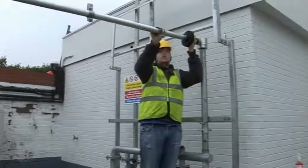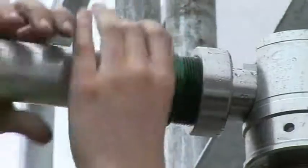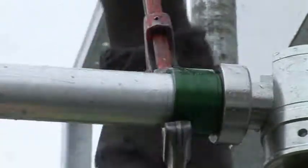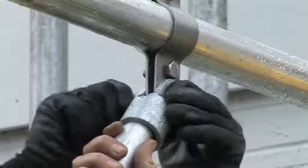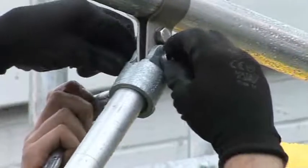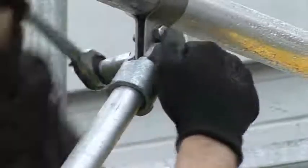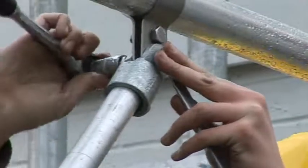Once the 2-inch aluminium riser is assembled, it can be secured to the knuckle joint. At this stage, the knuckle joint and riser should be in the horizontal position. At this point, the female swivel assembly on the handle needs to marry up with the stainless steel tube clamp on the main riser tube. Important to note that nylock nuts are used and that the swivel assemblies should not be tightened up completely, as this will affect the swivel action.